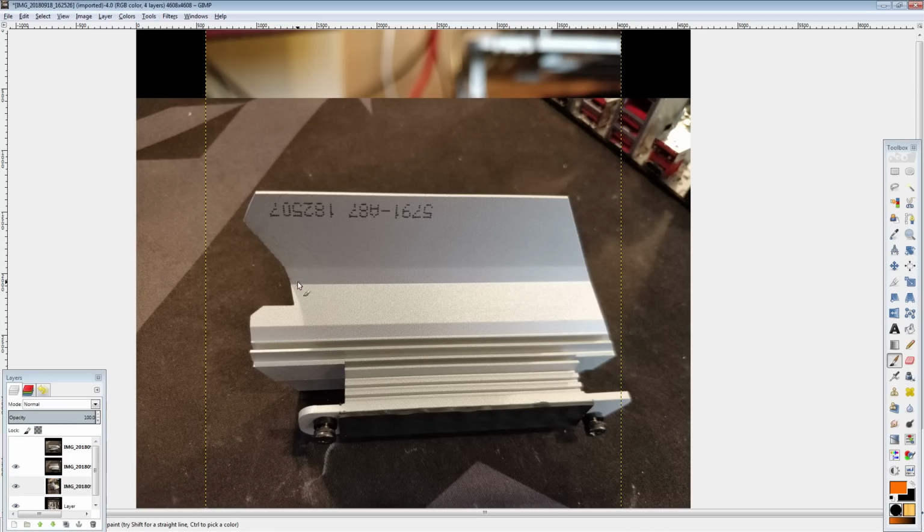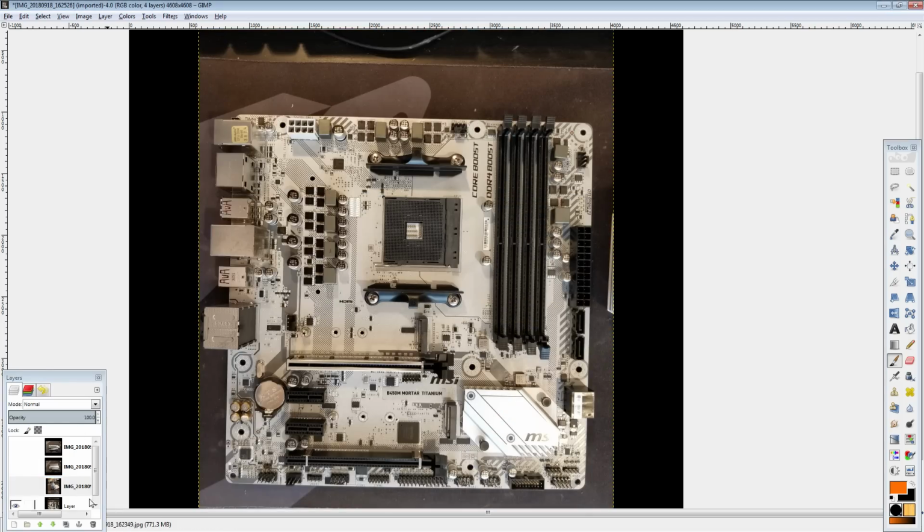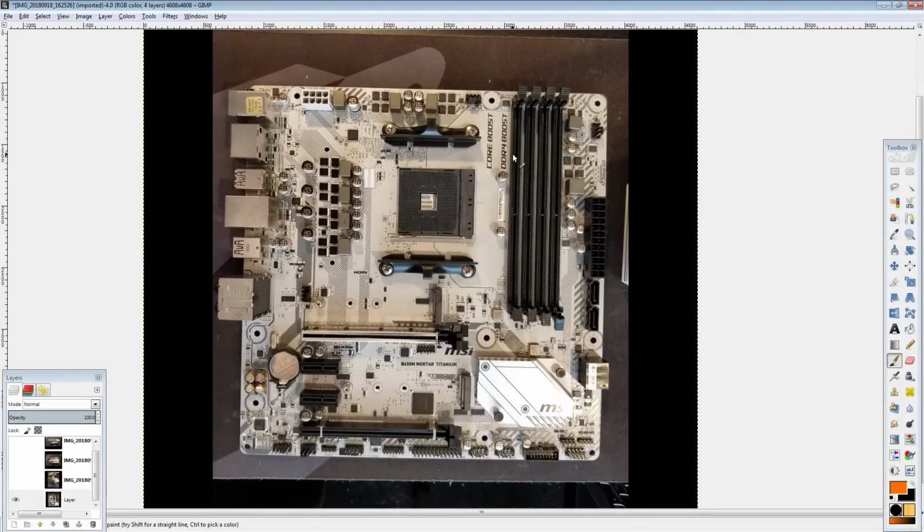The thing is, Gigabyte has that very good heatsink on like one board, right? They have it on the Gaming 7, and then all the other boards Gigabyte makes have your usual art blocks, and as you go down the product stack, they get steadily less and less functional. So this is the gold standard for an affordable heatsink as far as I'm concerned, and every other motherboard vendor should just copy this thing. Hell, they should buy these heatsinks off of MSI and use them on their own boards, because this is what I want to see. This has actual surface area, not the modern art pieces that everybody else produces. Because there's, say, the X470 Prime Pro from Asus, right? That has a perfectly good VRM with a god-awful heatsink.